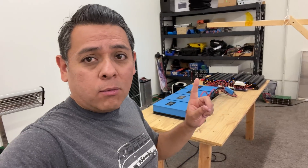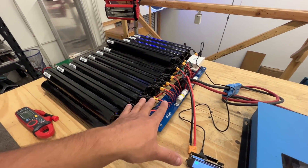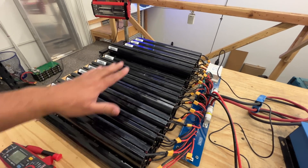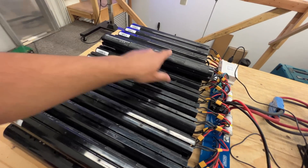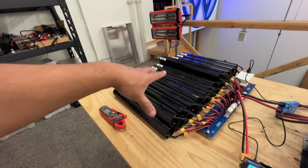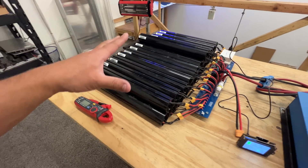Welcome to my Megalodongle X update. This product right here is a PCB power strip to connect a bunch of ES4 36-volt scooter batteries together to make a big battery. These are 187 watt-hour batteries, 20 cells each. When you put a bunch of them together like this, you're building something like a four and a half kilowatt-hour battery, so this becomes a real sizable battery.